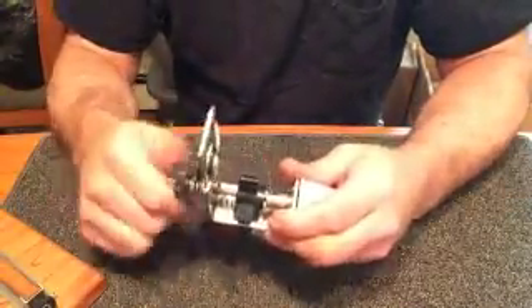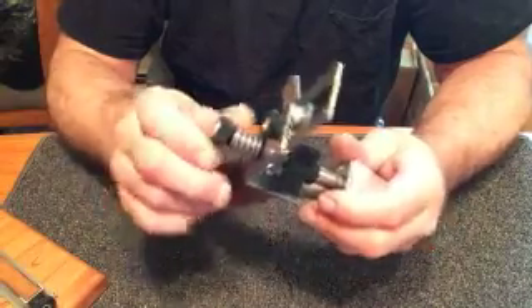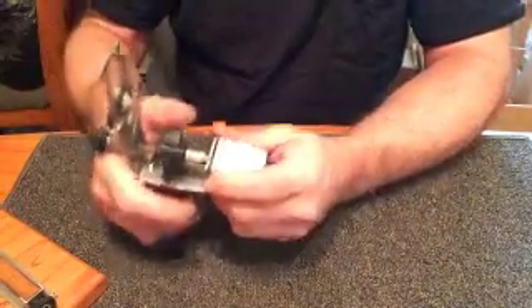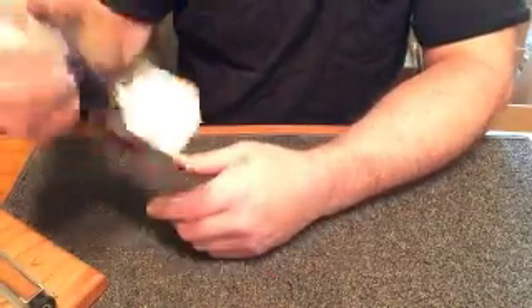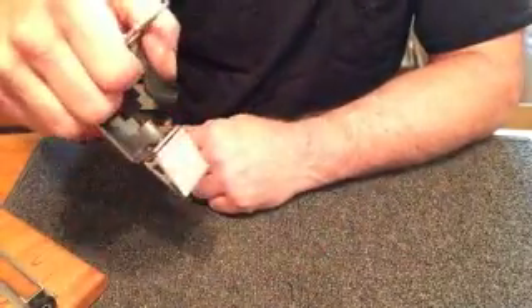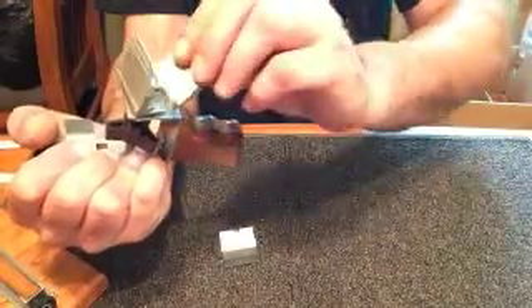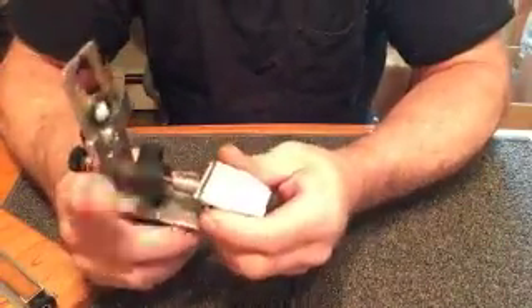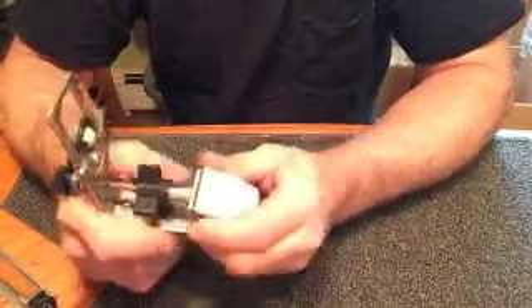Let's put that aside and move to the pen knife jaws. As soon as you take a big knife out, back off the tension knob — it should always be flush with the threads at the back. To switch the pen knife jaws — or any jaws — back the knob off a little further than usual. Point the sharpener down, push forward, open it, and it'll fall out. While you're still pushing on that plunger, turn it up to put the new jaws in. Gravity will help hold that jaw while you put the second one in, then just drop it into place and tighten the knob back up into working range.